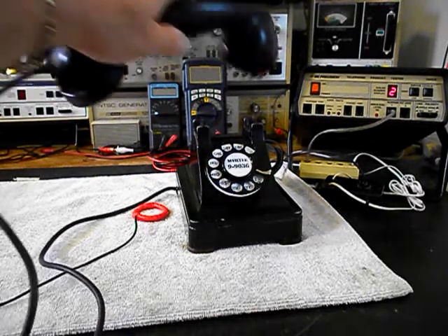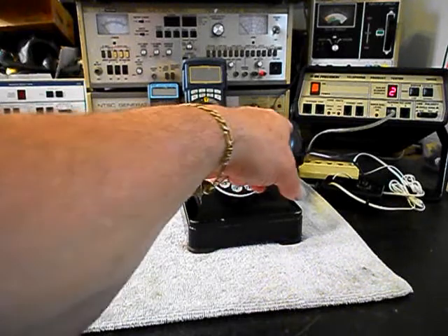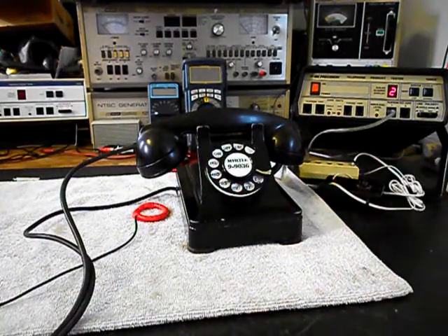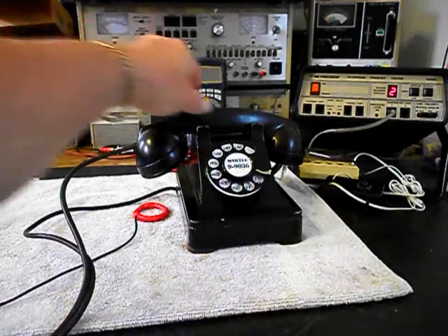So we know that this telephone is ringing in on a ring cycle, it's dialing out, it has transmit and receive. We can push this button on the switch box that gives us a line out and totally takes the analyzer out of the situation, and we can call a time and temp number. So we'll go ahead and turn on our amplifier and give you some dial tone.